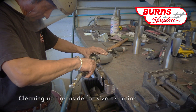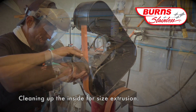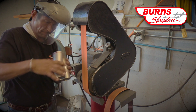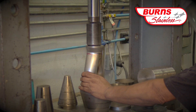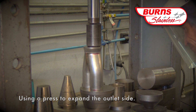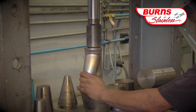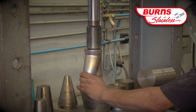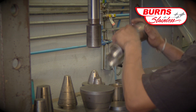As you'll notice, the outlet of the collector is not round — it ends up being an oval shape. So the next step is to make the end of the collector round. The way that we do it is using a hydraulic press. We have tooling that will be inserted into the outlet end of the collector and pushed in with the ram to form that round outlet. This is probably the piece of equipment that most people may not have at home to do this.